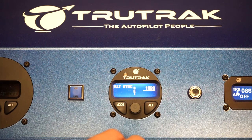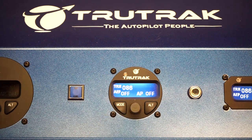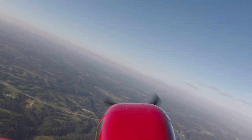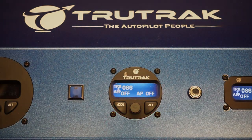Let's say for whatever reason it's approximately 2,000 feet here. We're going to set that at 29.99 — there we go. Now we know that the altimeter in the autopilot is synchronized with the altimeter in the aircraft. This is very important to do before you do any sort of altitude selects or any changes in altitude of the aircraft.